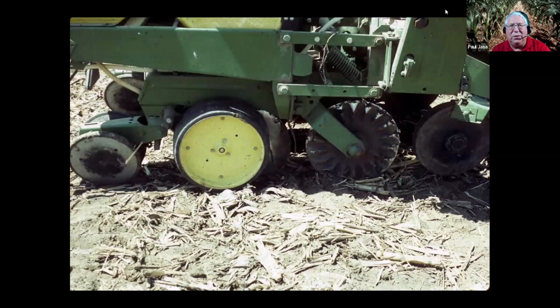I can like a coulter in stony soils, sandy soils, abrasive soils. I hate a coulter in wet, sticky clays because that coulter running that deep, it's pretty shallow there, will still bring up wet, sticky stuff to ball up the depth gauge wheels. But the key there is the heavy duty down pressure springs in there.